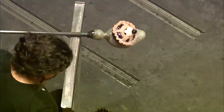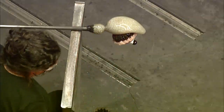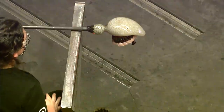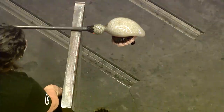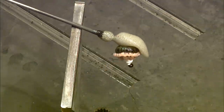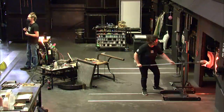If we have kind of cold glass and we have a hot tungsten rod, we can puncture through the glass. We can push through the glass. But while we drill through, we heat back a little bit further on that tungsten rod. We don't want it to get so hot that it sticks to the surface of the glass, but we want it to be warm enough that it can puncture through. So we torch the backside of that tungsten rod to keep the heat in while we're drilling through that pie. That's why we torch that drill bit while we continue to drill through the glass.